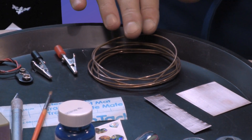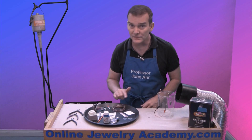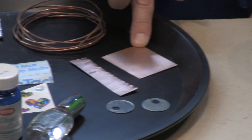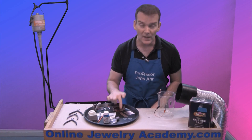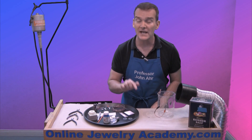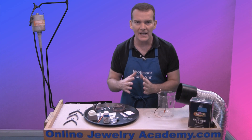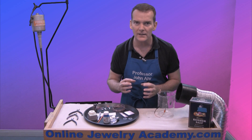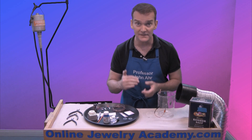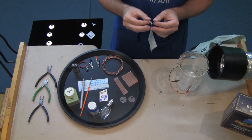You're going to need some 14 gauge copper wire. You can use a larger gauge but don't use a smaller gauge. You're also going to need copper for your project and some scrap copper. The scrap copper is attached to the negative terminal and your project is attached to the positive terminal. We need to protect your piece from being completely eaten away — you've got to protect the sides and the back area because they will be attacked too.